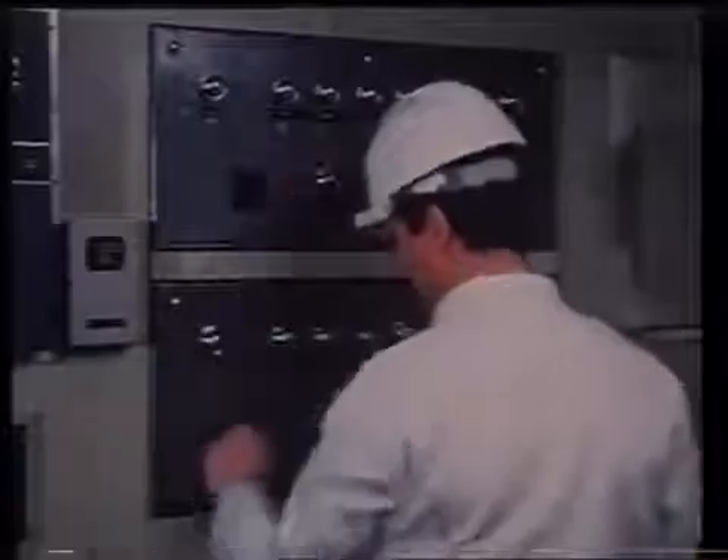Check the navigation light panel and prove the alarm system to be working. The surveyor may remove a fuse to check if the appropriate alarm is operating correctly. Check all exterior light fittings and replace any burned-out lamps.